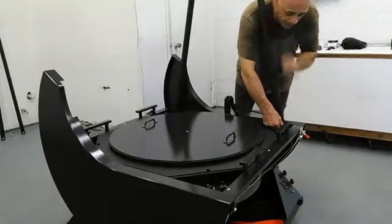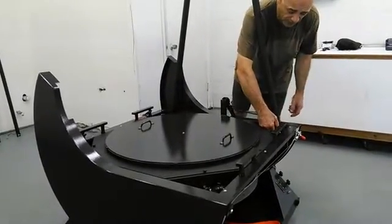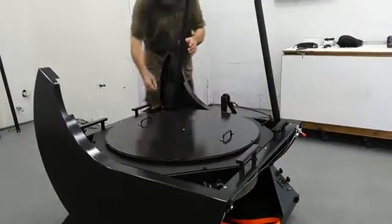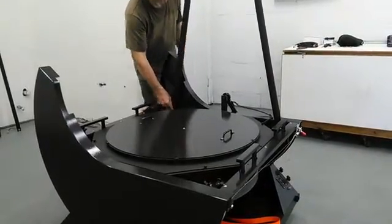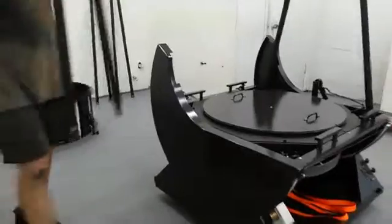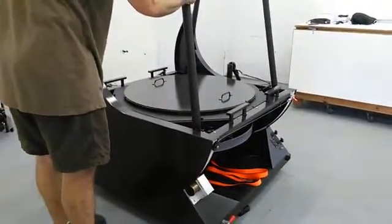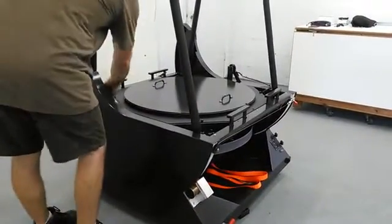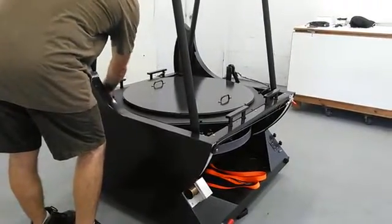On the lower truss mounts, in the plates on the trusses, there will be recesses that the thumb bolts recess into, so it's not necessary to over-tighten them — just bring them up, get them snug, and that's it. The next truss goes on the other side. Again, line up the slots, lean forward slightly to clear the cutout, stand it up straight, and tighten the two thumb bolts.